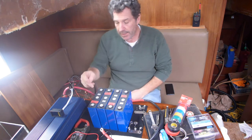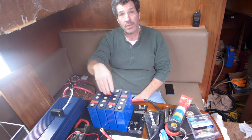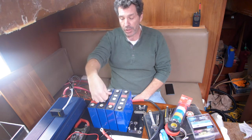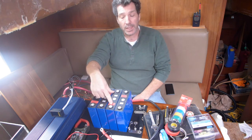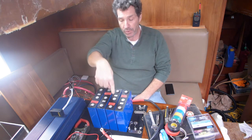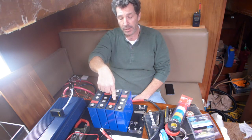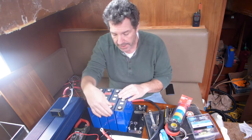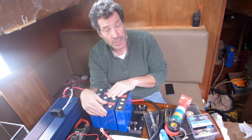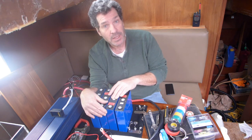Since all these cells are basically the same, I have the red tape designated. They're 3.2 volts, so we're going to put these in series together to get a basically 13-volt battery. I've been able to charge it up to a little over 14. I do have one cell that will actually charge up to over 4 volts — pretty impressive for a 3.2-volt battery. Usually they top out about 3.7 at the very most. 3.6 is usually considered max for the 3.2-volt prismatic lithium iron phosphate cells.